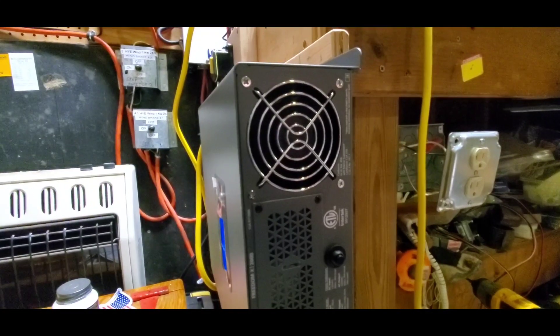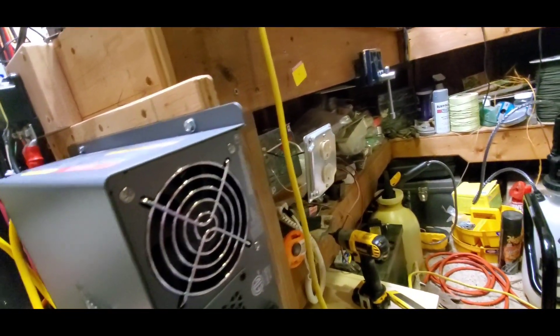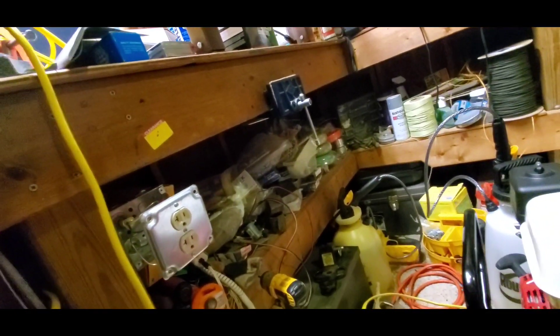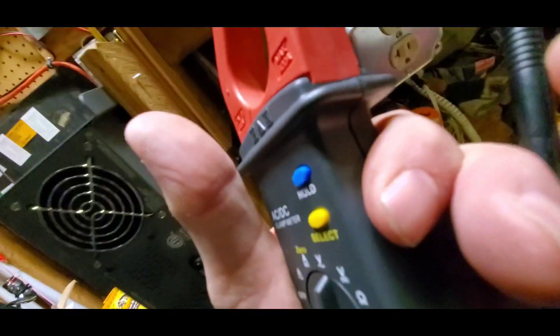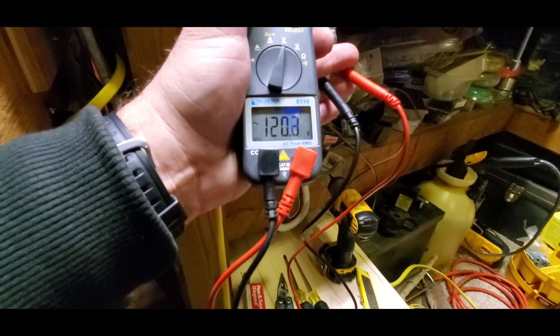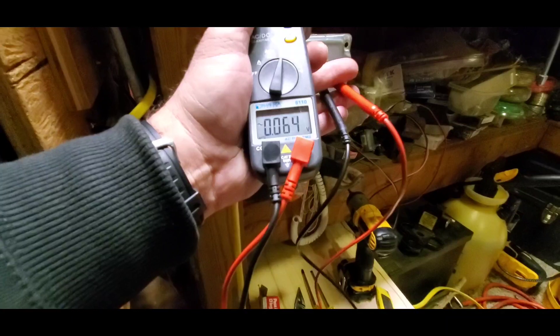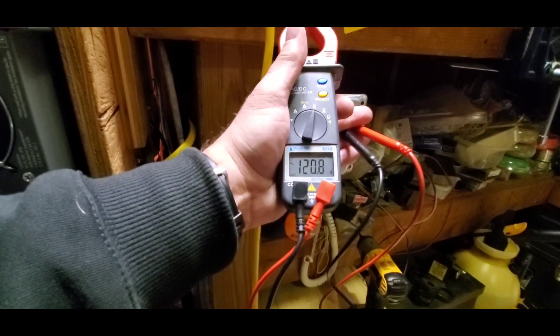She's quiet — I mean, you can hear it, but that's a bad puppy. We're going to check our voltage, and this is going to be kind of tough one-handed with a cell phone. We should be getting 120 volts. I can't hold it steady — sorry y'all. There we go: 120.3 volts. That's good.